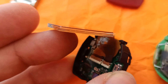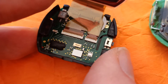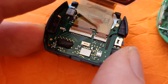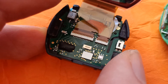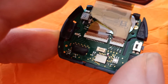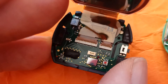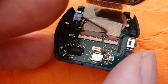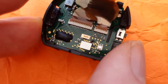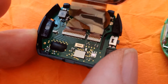If we pop the hood, the display itself is attached to the substrate — you can see those two layers of LCD and LED glued together. You can't really repair this; you'll have to replace the whole thing if it goes bust. They are fitted onto the substrate with standard clips that are quite easy to disconnect. That's also a hack you can apply yourself without any damage to the movement — just disconnect the layer responsible for the LCD from those clips.